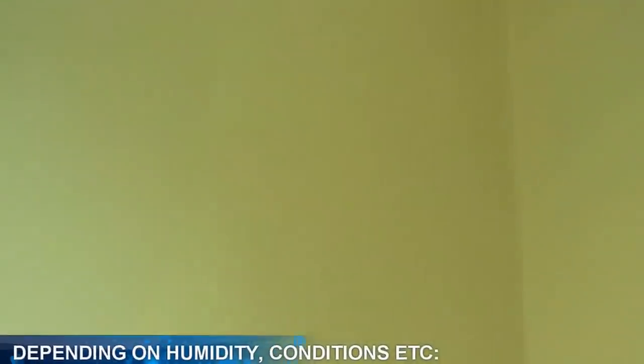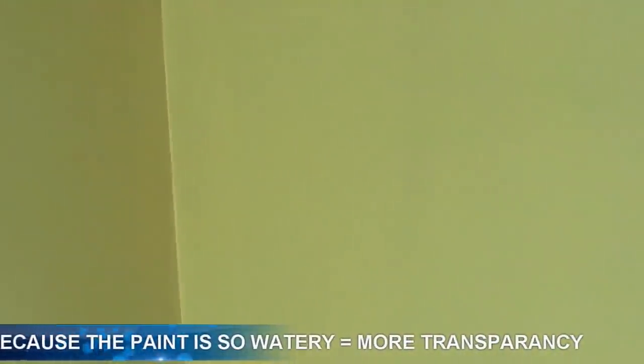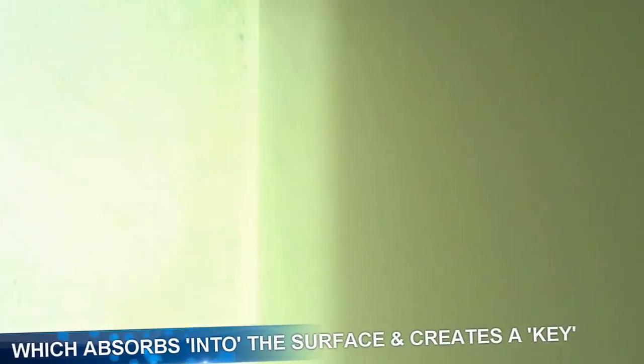So once you've checked it, you take off any little lumps on the wall, maybe a plaster left or little bits of filler or whatever, you take them off with a scraper when this surface is fully dry, and then you commence as normal with your painting, you know, filling the edges with caulking to seal around the edges and get a nice finish. You'll go round the ceiling, round the walls, round the perimeter.